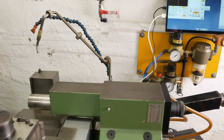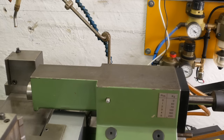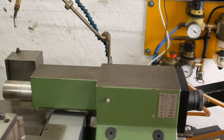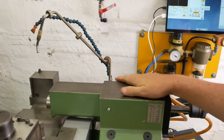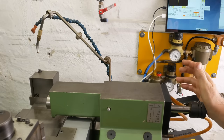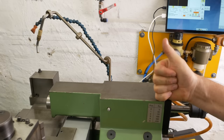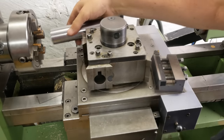What I've done here is just use some basic ladder logic to connect this digital input, in this case it's pin number 3. M65 P3 retracts, M64 P3 extends. Cool. Now obviously once I've got my control panel built up, I'll also make some sort of a manual switch on this, but for now, it's working. Cool. Alright, let's make another output shaft.